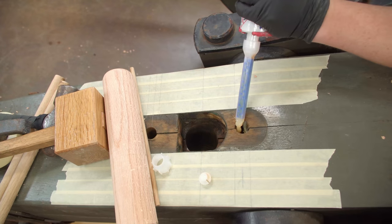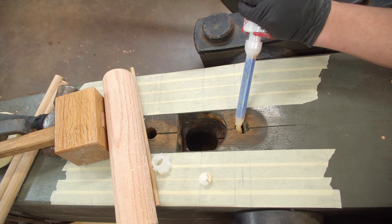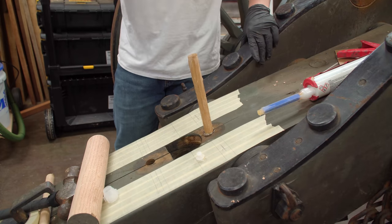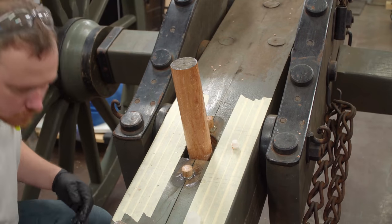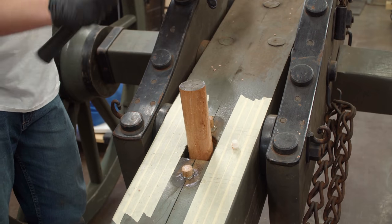Back to the project — at this time all I had was the medium-duty gun, so the struggle was definitely real. After getting a bunch of thick epoxy into the hole, I applied a liberal amount to the side of the dowel, spread it around with a piece of cardboard, and then drove it home with a mallet. The process is the same for the other two dowels. One thing to note is the grain direction on the dowels — I am gluing them in perpendicular to the grain on the carriage.